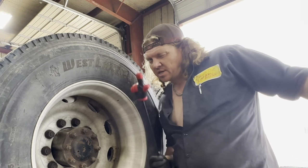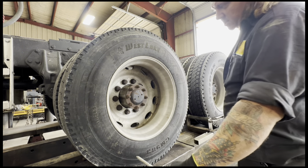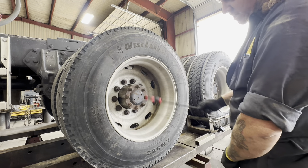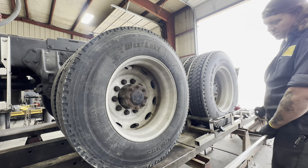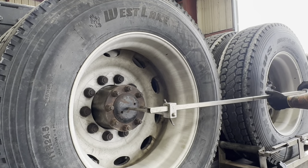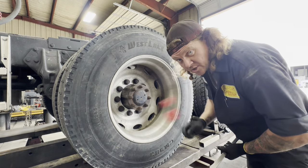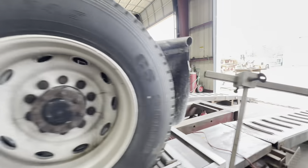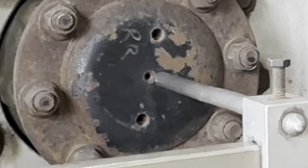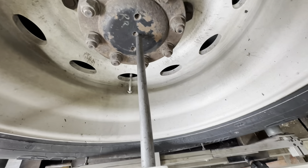This is usually where we find out if anybody's paying attention — if anybody's doing it right, or how bad the machine is — because this manually checks it. There's a hole right here dead center in this axle for the tooling. We stick it in that little thing, and moment of truth — we go check the other side. And oh, it's off. See that? The measurement is off.